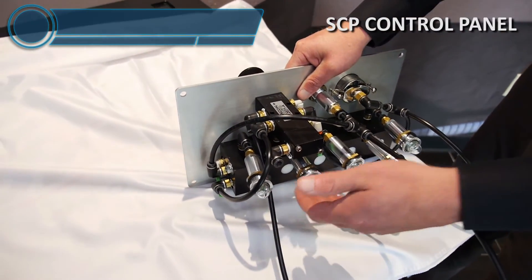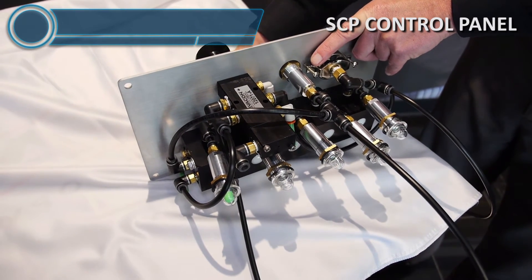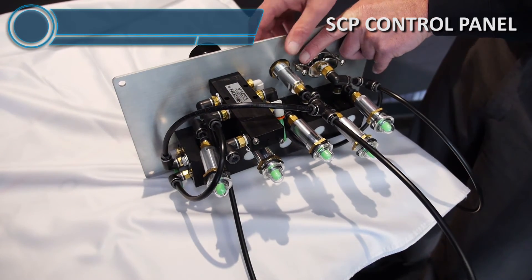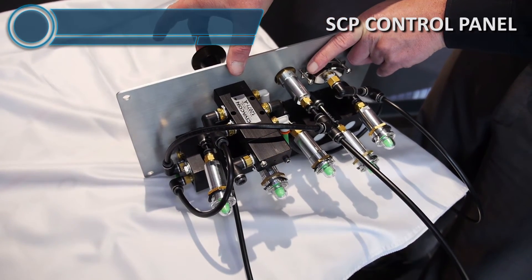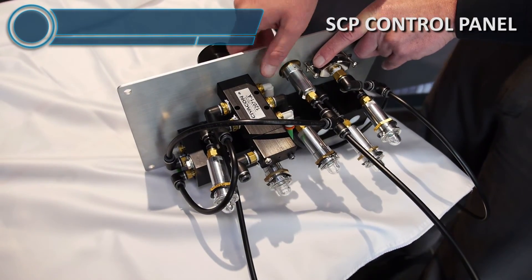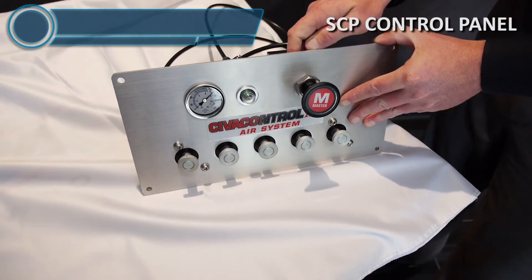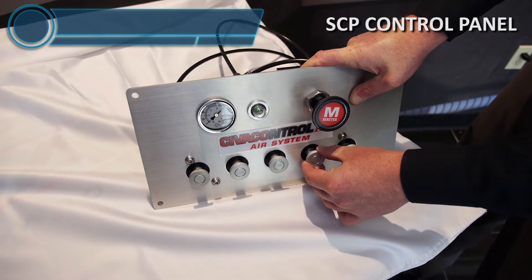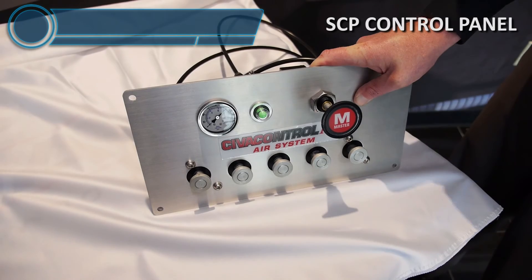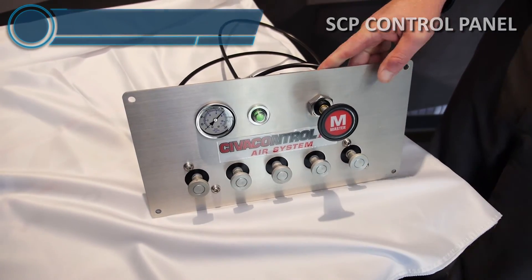Now let's have a look at the backside of this control panel. I've connected some pop-up indicators here to simulate the internal valves. I'm going to open up all the compartments — you'll see that's sending the air feed to the internal valves. If I hit the master switch closed without touching the compartment knobs, you see it closes your internal valves. You will not have access to the compartment switches until your master is open. These knobs won't pull out until you pull your master — then your vents open and you can access the compartment internal valve switches.